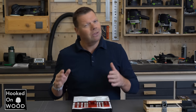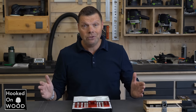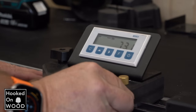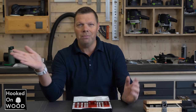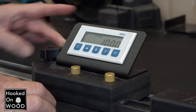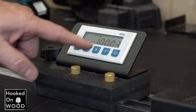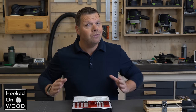I tend to say I do not like that these products have some deviation, even if just a few hundredths of a millimeter and within tolerances. On the other side, I am very proud of my digital stop block for my miter stop. Although it can measure to 1/100 of a millimeter, I set it to one-tenth of a millimeter — but this also means that if I set it to 100.0 mm, it could be 100.03. And I take that for granted without any hard feelings. So these setup blocks have the same or even fewer deviations, and I should feel the same about them.